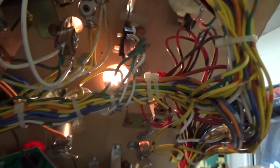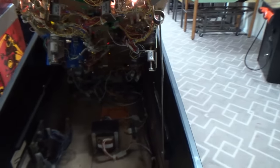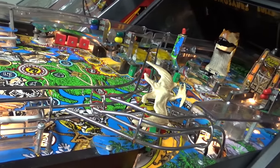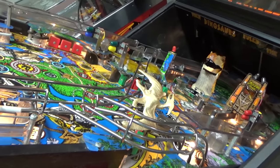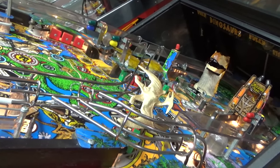That one is just a light that is always on — it's got white and yellow wires running to it. Even though it looks like a lamp that could turn on and off because it's in the in-lane, it's not. It's just always on. Same story on the other one: white with a yellow stripe and yellow. So in other words, every single lamp on the play field does not work. That's almost assuredly a missing voltage, and we were just screwing around with the power supply, so it's probably something that happened then. Let's see if we can track that down.